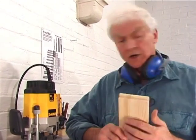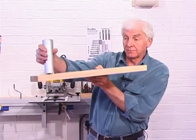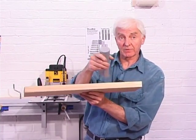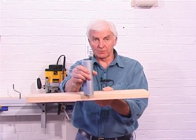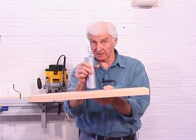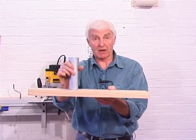So, how does the wood rat work in practice? How does it compare with what you normally do? We identify 6 basic areas of making joints. Profiling, down the board. Functional profiles like grooves and decorative profiles. Then, around the end of the board, tenoning and bridle joints. Then working across the board, trenching for dado cuts, housing joints and sliding dovetails, very important. And then cutting square holes downwards and drilling for mortising and for doweling.